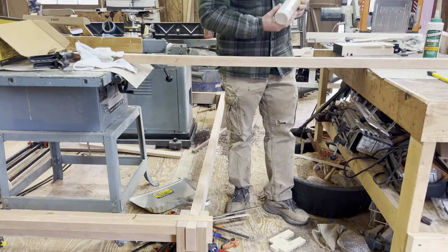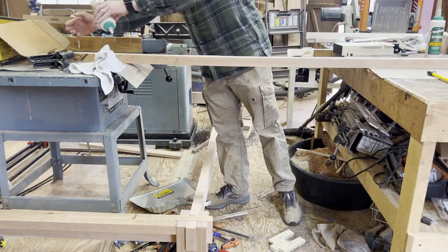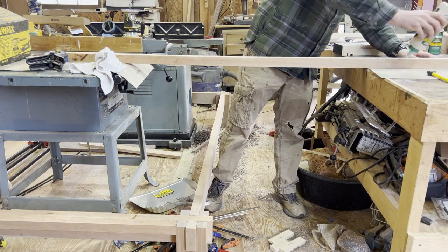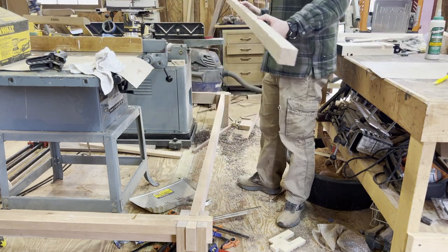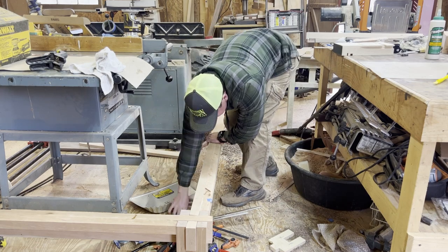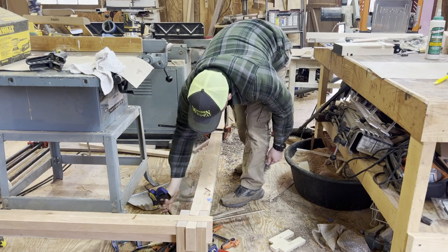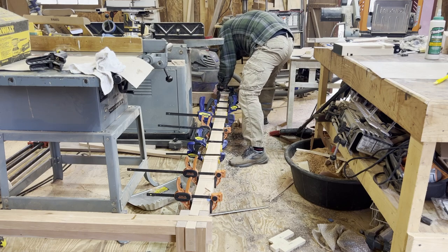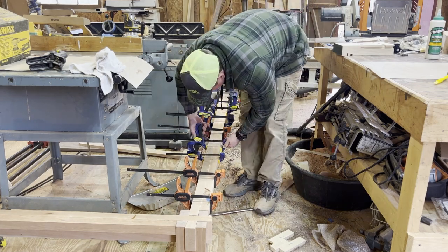In fact you'll never see the crack because the castle joint on the legs will cover it up — it'll be on the inside of that joint. After I got it all fit nicely, I came back and glued up what I call the side rails — one-and-a-half inch by one-and-a-half inch pieces that will go on the sides, footboard, and headboard all the way around the bed. I used a little bit of glue and then more than a few clamps.